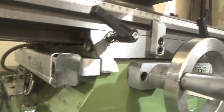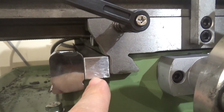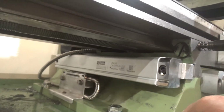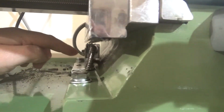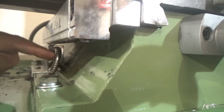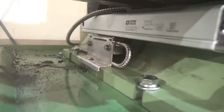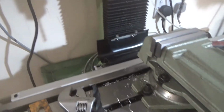So this is, I suppose, the Y dimensions. I've had to add this block here, a 20mm square aluminium block, bolted to that with some counterbore bolts. Then that rail is bolted to that, just to give it the space to get the actual bit that does the gubbins away from that angle. The cable's tucked in like that. It's not going to be a problem because that bit doesn't actually move, it's this bit that moves. And a little aluminium bracket holds that in place. That base bit doesn't actually move anyway, so that cable's never going to move. Fine and dandy.